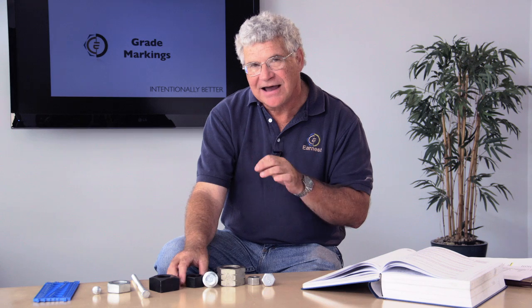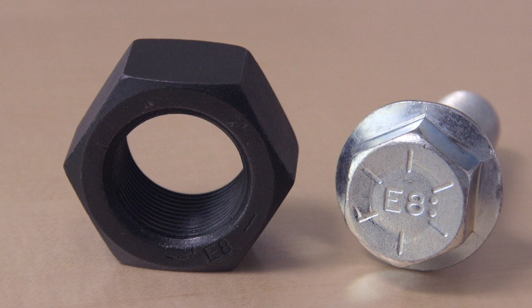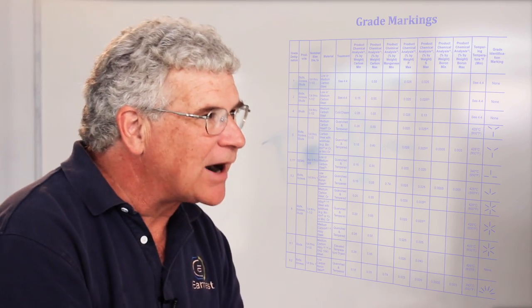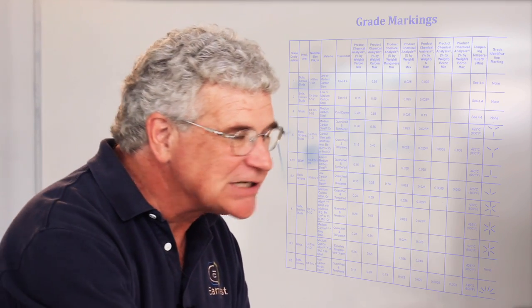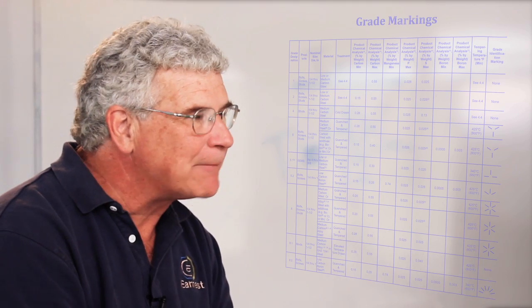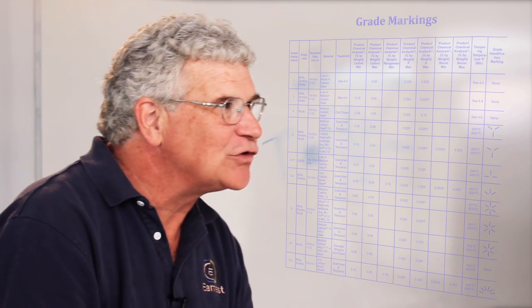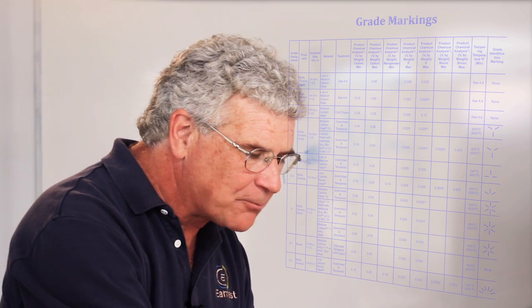When you're dealing with nuts, the nuts are a lot more complicated. The nut marking for grade 8 is two circumferential lines only 60 degrees apart, so the two lines are relatively close to each other, plus the manufacturer's mark. E8 is our manufacturer's mark, so it makes it easy to identify. Nut markings can get very complicated, especially when nuts have damage to the top of the head — you're not sure if you're seeing a circumferential line or just a nick in the product.